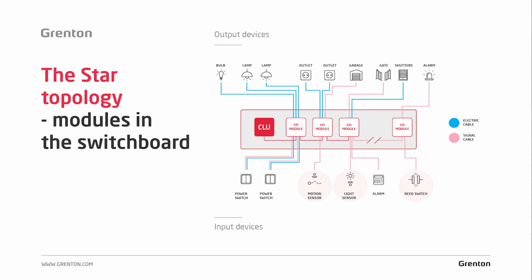Let's stop here for a moment as we are at the wiring stage. We discussed what cable and how it should be led to each of these elements, but I think that it's also very important where and what sensors can be mounted. If we want our system to control heating, there will be a temperature sensor in each zone, in each room where we want to control the temperature. So it's worth considering here, when distributing the system, to bring the Grenton bus into this kind of room, for example, to connect touch panels or a smart panel. Or if you don't plan any of these panels in a room like this, then it's worth bringing the UTP cable there so that it's possible to install a temperature sensor in the future.